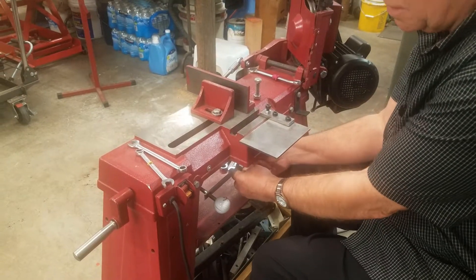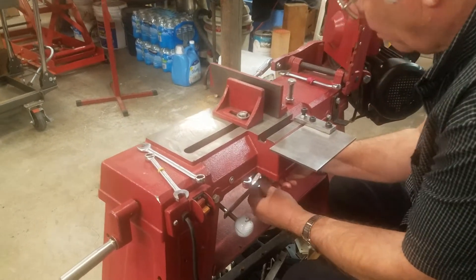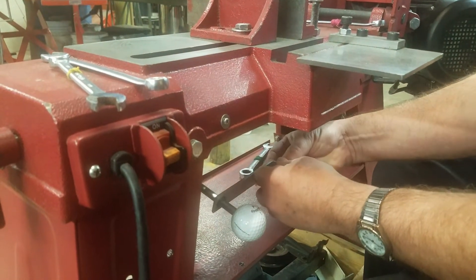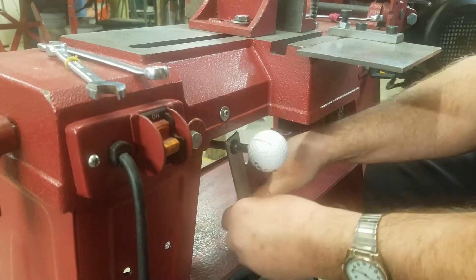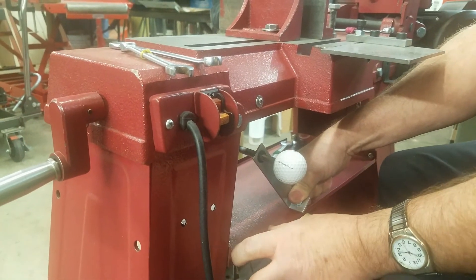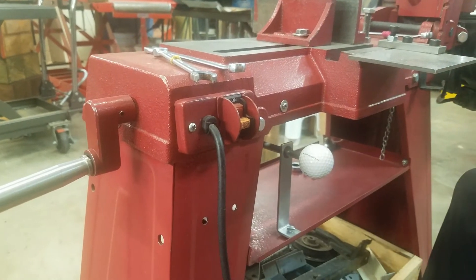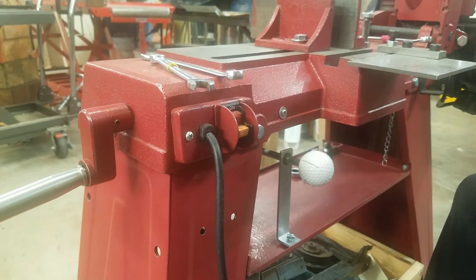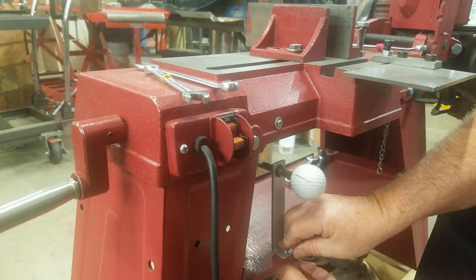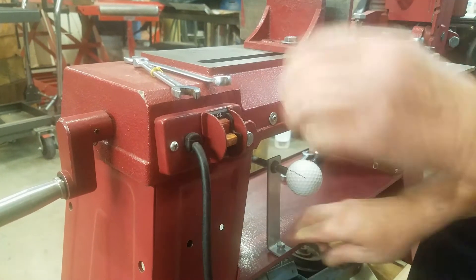On this side there's a little bracket on it that holds the control knob. Now I drilled a hole right here — it's about 3½ inches out and a ½ inch in. A ¼ inch hole for a ¼ inch bolt, and that holds your control knob so it's really stable and in just about the perfect location for working with the saw.